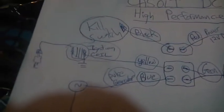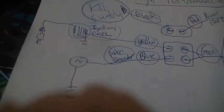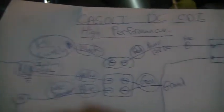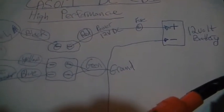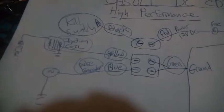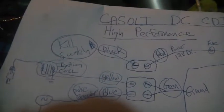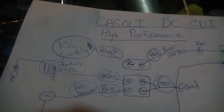So you can see your black, yellow, and blue on this side. From the bottom: pulse generator, ignition, on/off switch. On the other side: red — no surprise, it's power — and then two greens which are ground. They're common grounds: the battery hooks to it, the pulser hooks to it, the ignition coil hooks to it, and the metal part of your spark plug hooks to it. The kill switch hooks to it too, but right now I have it floating. Let's see if I can get this thing to spark using one hand — the battery pack is a little low so I'm not getting great sparks.